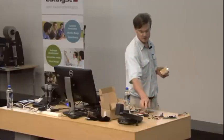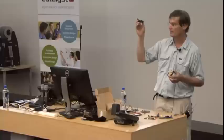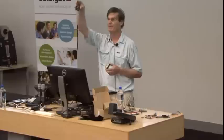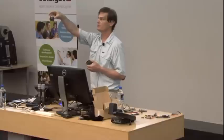We don't actually have the laser rangefinder on this, so we're reliant on it being a fairly short flight, so we don't get a lot of barometric drift. On a larger plane for a longer flight, we normally have a laser. Linux-powered flying robots with lasers on them, what's not to like?